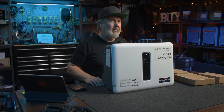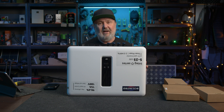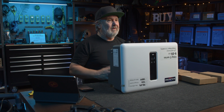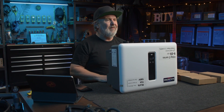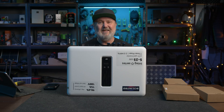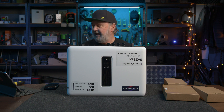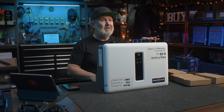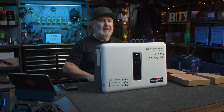Why do you need to worry about that short circuit rating? In Australia, we require under AS/NZS 5033 — our PV array standard — that you allow a 1.25 times safety margin on top of the PV array's short circuit current rating. So if you use the reciprocal of 1.25, you multiply your short circuit rating of the input by 0.8 and that brings you down to 16 amps. So the maximum short circuit rating of a panel that can be connected to this is 16 amps.